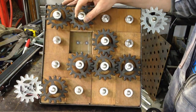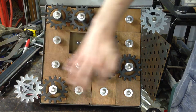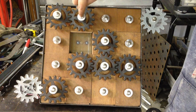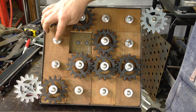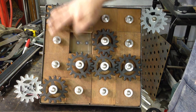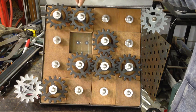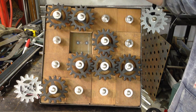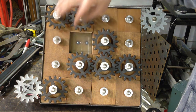I tried to address this in a few different ways. One, I put these little magnets in on each square right underneath the main bolt. Some of these I used stainless and these I used regular steel. I was hoping the bolt or the nut on the bottom would be enough to hit the magnet, but I think with the extra weight of the gear and the mechanism, I will have to add just steel hardware. That additional steel should create a stronger lock on that magnet.